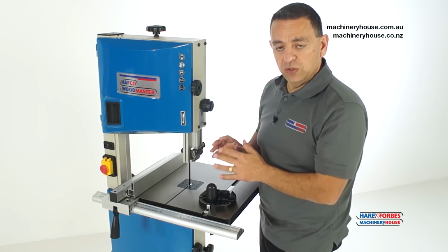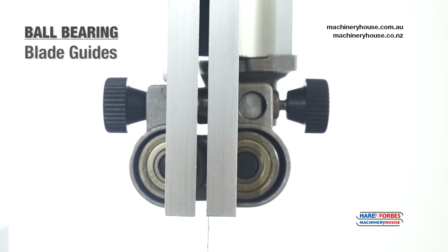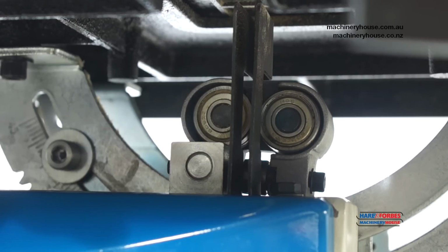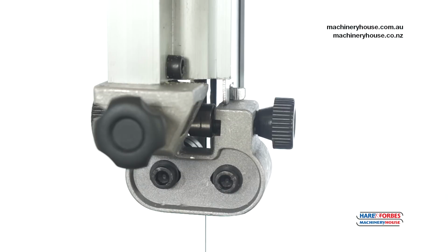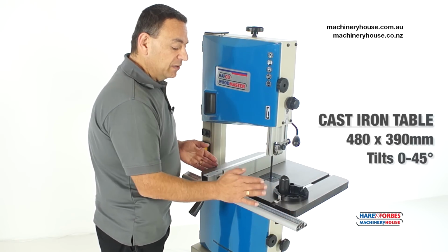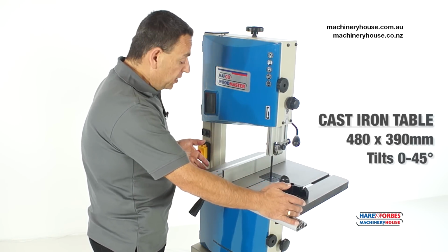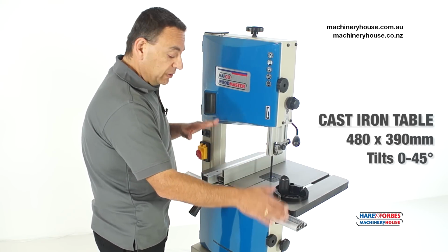Now also to ensure the blade is straight, it has ball bearing blade guides on the sides, top and as well as on the bottom, with a rear guide roller on the back to keep it supported. Over here we have a cast iron table that's 480 millimeters wide by 390 millimeters deep that also tilts.